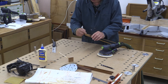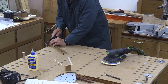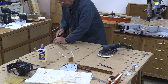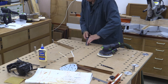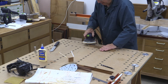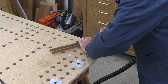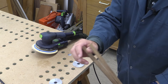Just before I sand, I'm going to cut the corners off here so I can round this end completely — dead easy, you can do this by eye. I've got a little pull saw. These are cheap and cheerful pull saws from Screwfix here in the UK, made by Irwin, and I absolutely love them, especially for flush cutting where you keep the blade flat against the surface and trim something off. So that's ready to be sanded. With these ends which I've just trimmed, I can now sand them into a curve. That was really easy — super duper. I'm just going to break the ends here as well.